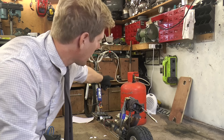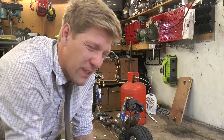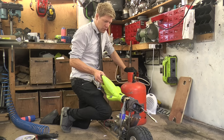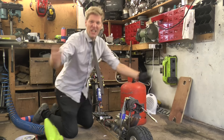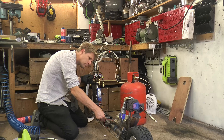I took the small gas bottles off and replaced it with a big one. The little gas tube — I thought I'd drilled quite big holes in there, because the cordless drills I've got will only hold a minimum 2mm drill, so I've put some smaller holes in that. If this doesn't work, I think I'm going to have to completely look at the design of this thing. It was working, but then it didn't work. I've got it to run for about 5 seconds, but it runs really poorly and I can feel it blowing back out of the compressor inlet. It's like it's expanding so much it can't get out of the turbine side, so it's having to blow back through the inlet.